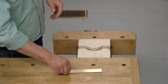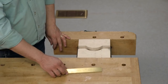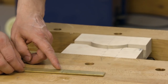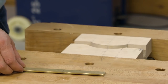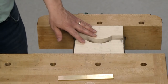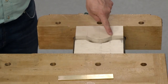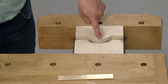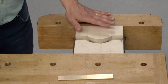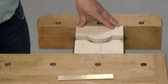We're going to start with a blank that's cut to our final length as shown in the plans. I've drawn a center line on one of the faces and edges of the blank. To bend it we're going to use a two-part bending form made out of maple. You can see it has the flats on either side and the curved shape in the middle. Because we're using brass I can attach the forms to my bench vise using some double-sided tape.